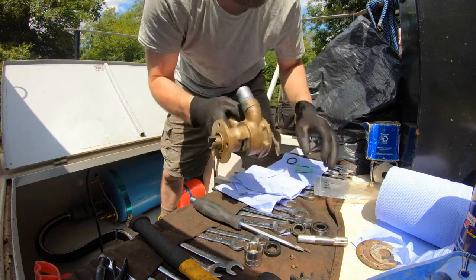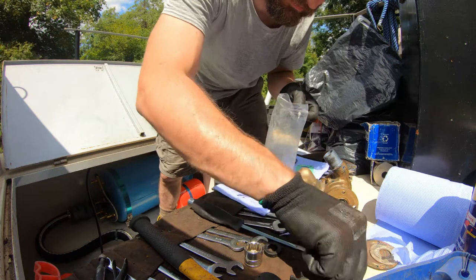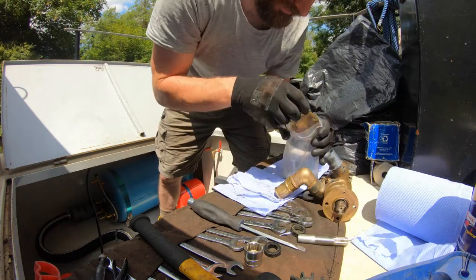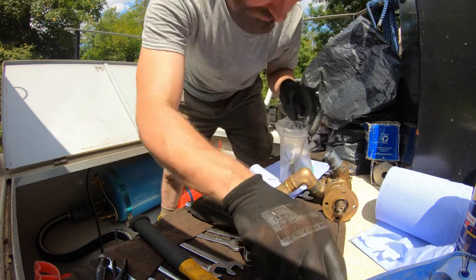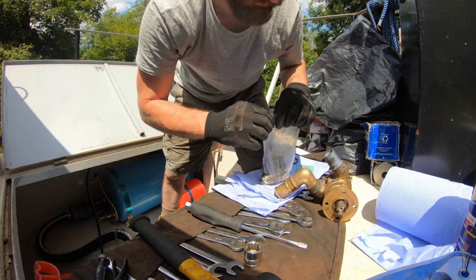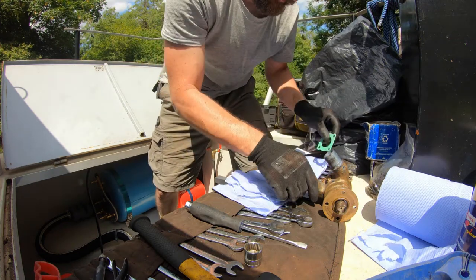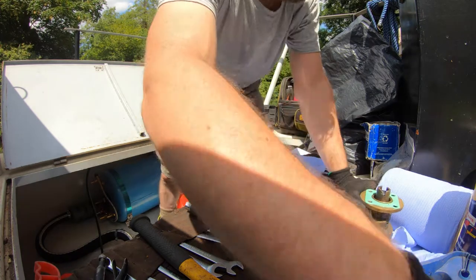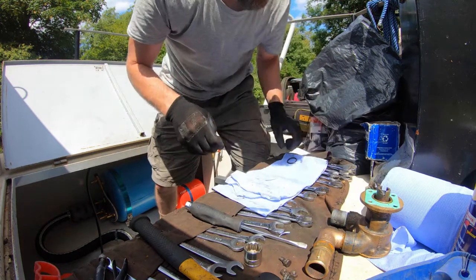Good, that's the pump done. Let's get it back on. Let's put the old bits back away first, I'm going to lose them, for the owner to decide what to do with. So I suggested before, keep the front plate and the impeller, and recycle the rest. You need to clean the main nuts and bolts that held the unit on, because they're a bit dirty.